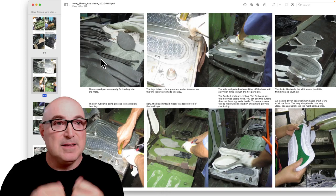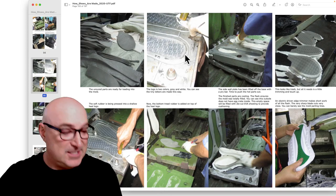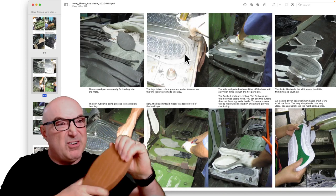If you just pull these pieces apart, you could do it with your hand — it's literally like tiny taffy. What the worker is doing now is loading this raw rubber into the mold so that it can be cooked and take the shape. Here's what a finished cup sole looks like — you can maybe see this gum one better. All the rubber pieces are fused together, and that process is called vulcanizing.